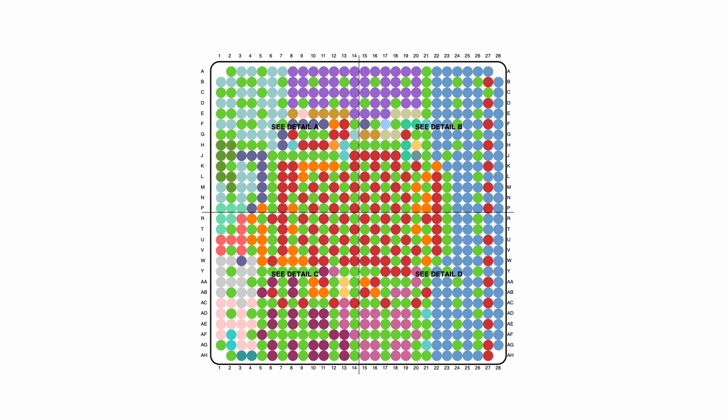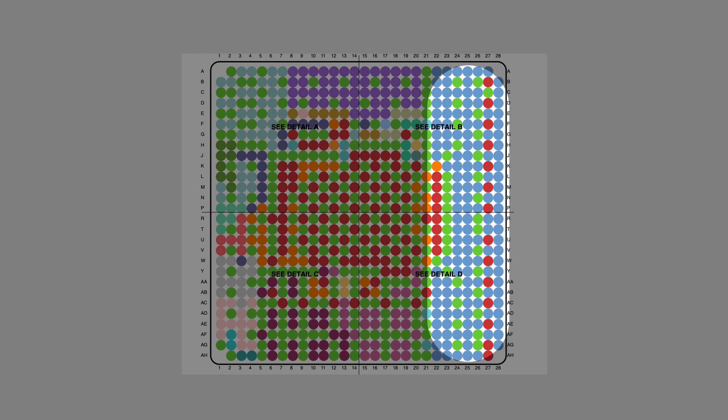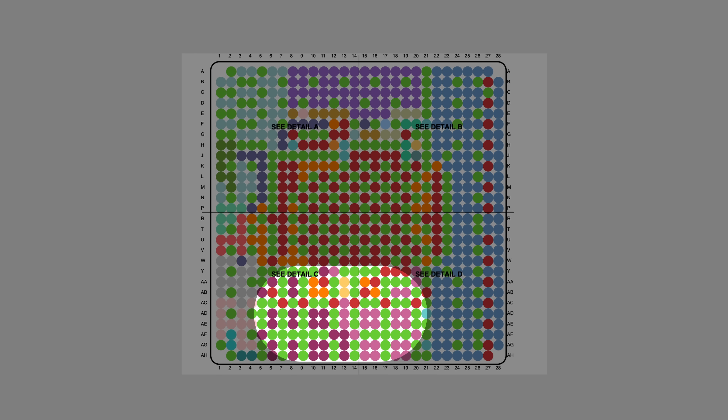Since we're talking about pins, let's look at the CPU pinout. It might look a bit intimidating at first, but all you have to do is squint a little and the picture becomes clearer. The central quarter mostly has green and red balls connected to ground and power respectively. Then there's a wave of blue balls on the right — those all go to RAM. Purple ones on the top go to the NAND flash, and the bottom part is filled with pink, dark pink, skin pink, and grey balls. The latter two are RGMII — Reduced Gigabit Media Independent Interface — simply put, two gigabit ports.